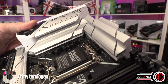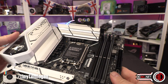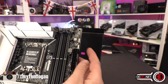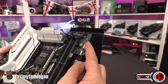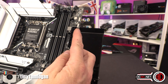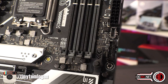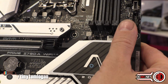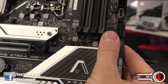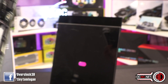You can see the power phases around the outside. The heat sinks are a bit basic, but in reality I've not had any heat problems with these yet. You get your 4-pin and a 3-pin up here for RGB — so normal and then addressable. Down the side they are solid pins. USB 3.2 Gen 2, USB 3.2. You do get the new slider as well — rather than it just rocking backwards and forwards click-clack, it slides, and I love this. This will be what Gigabyte are copying next year.